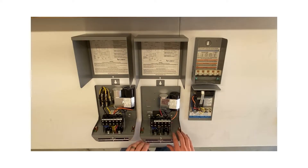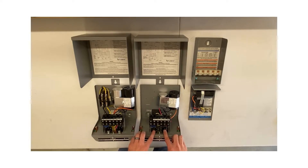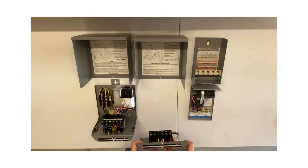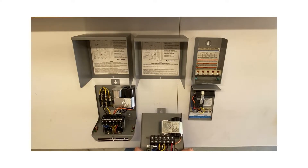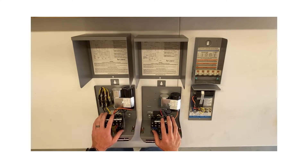The next one is a standard box. This one in front of me is a dual-rated one horsepower and one and a half horsepower box. It's a larger enclosure and has the addition of a run capacitor. It also has two overloads down here — a start overload and a main overload. These are overload protection: if they detect that the motor is pulling too many amps, they will trip. On the bottom there are reset buttons — these buttons are by nature very spongy, so press them really hard to check if one has tripped.